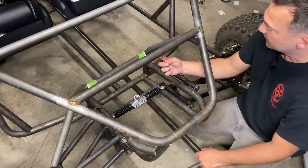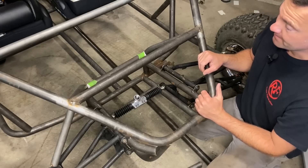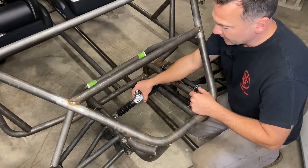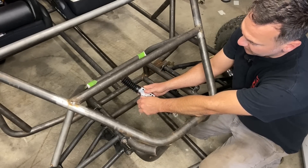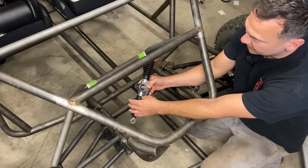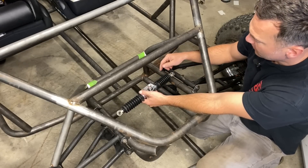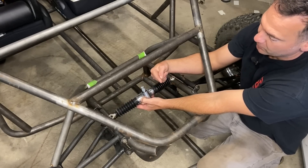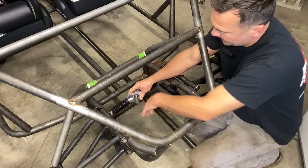I've got this bar to use and a triangulation point for the top mount, so the shock should be pretty easy — I hope I'm not jinxing myself. For steering, I'm going to go with my tried and true steering rack that I've used on all my buggies. I like it — it's replaceable, rebuildable, and customizable. Since we're running the tie rods on the back side of the hub, this is actually going to go with the steering yoke towards the front instead of towards the back.